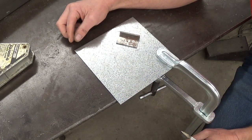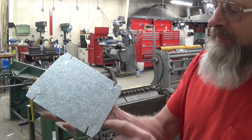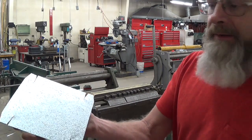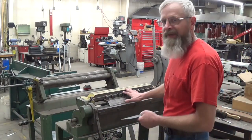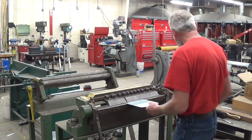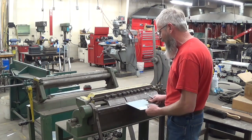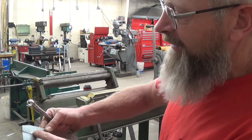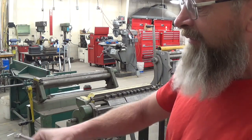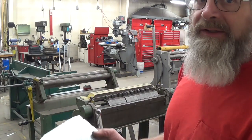I'll get these cut out and show you how the box and pan brake works. I've got my piece cut out — I cut those little angles out so the tabs fold up and they'll all be on the same page. Now I need to use the box and pan brake. First I'll get it adjusted to make my bends. I can slide these pieces around and adjust it so when I come in to do the box, I have one edge fitting here and one edge there, which will hold solid pressure and fold it steady.